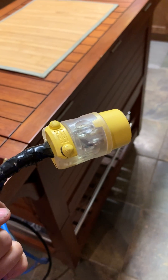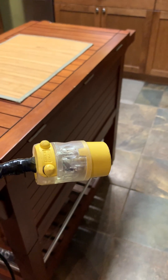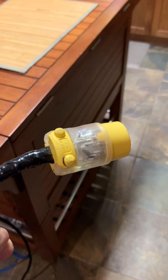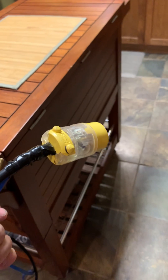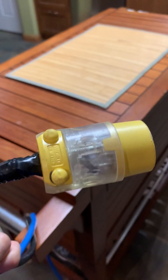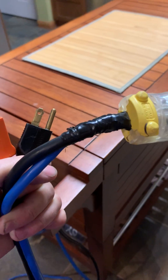I added this plug. It typically glows with a neon bulb inside when it sees 120 volts, to tell you that you have a live circuit. I bought this cord and wired in my two cords — the two hots going to each of the hot and the neutral inside the plug, the ground going to the ground, and both neutrals of the cords not used.